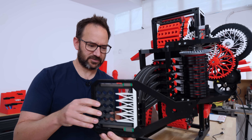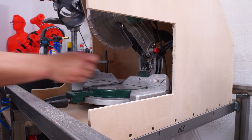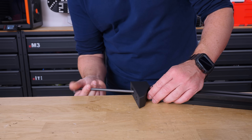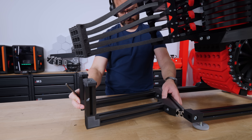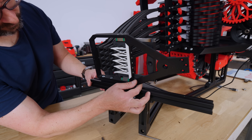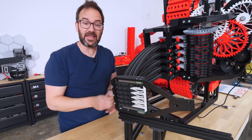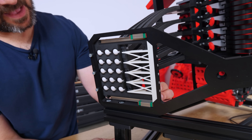Now I'll make a support to get this hanging here. I'm going to use more 30x30 aluminum extrusions, cut to length and tapped on both ends. And I'll use a few 3D printed connectors to attach them to the front extrusion on the base. At some point I will need a less convoluted way of connecting all of this, but for now all of this will give me a base just on the right spot to attach the frame. I added this interface layer in here to leave enough space for the marbles to go when I need to discard them. And now if I get some marbles in here, I can discard them.